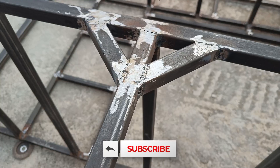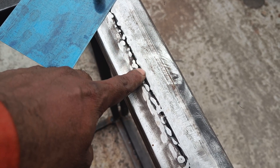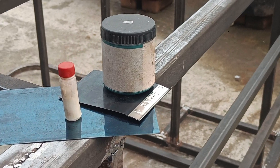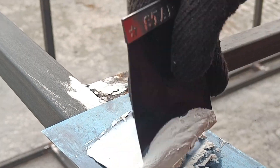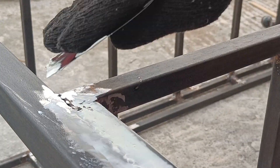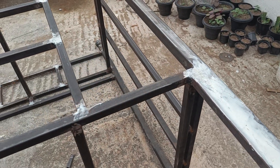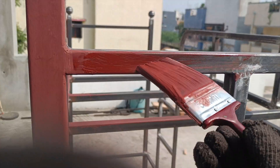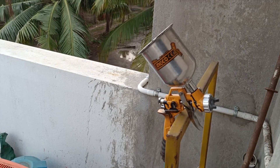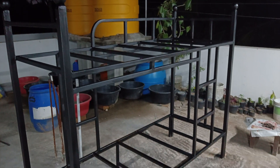To get to the final finish: the welding seams are not uniform — I'm not sure if that's even possible with arc welding on thin metal pipes. All the gaps can be filled with metal paste, which comes in various types. This one is a generic, inexpensive two-part mixture that dries in less than five minutes. After applying the putty and sanding it down, a coat of red oxide was applied with a brush to help paint adhere better and prevent rusting. Then the whole frame was pre-painted with matte black.